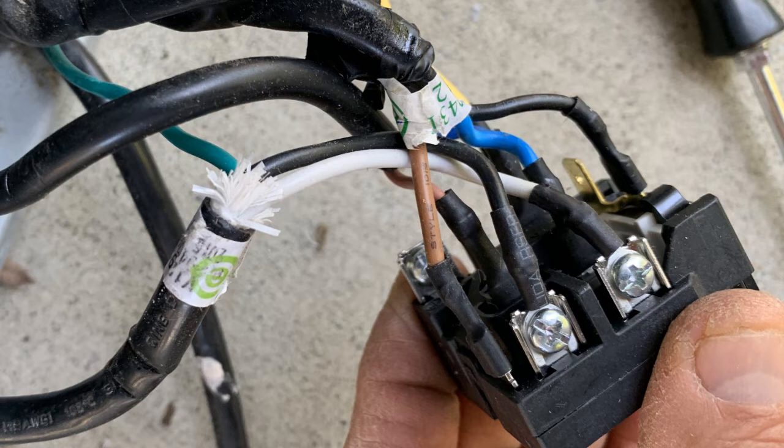They're made pretty easy to work with. The only thing you're really going to be concerned about, other than pushing the correct pins onto the compressor, is to connect here the two black wires coming out of the unit that you purchased. As you look at this block a little more carefully, you see on the left-hand side there is a brown wire and a black wire.